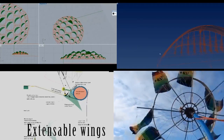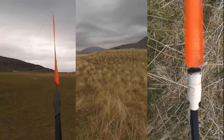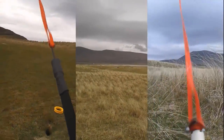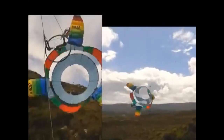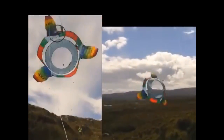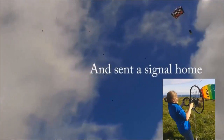The idea is unique because these kites fly a fast, wide, circular path using an inflated ring hub — that's kind of a parachute. There's no drive shaft for transmitting the torque to ground. Instead, tensioned rings spread out with tethers between them, so you can twist energy down to the ground. The kites don't need control yet — I'm going to build that into future versions with either air elasticity or electronic controls. There are only soft structures and one very lightweight roller blade bearing up at the very top, making it a very safe system.